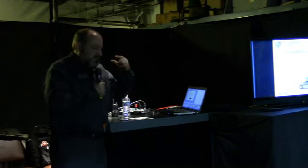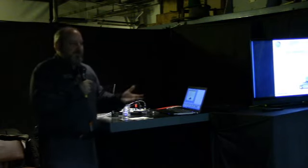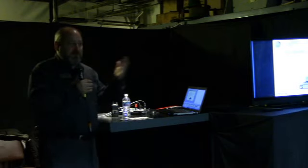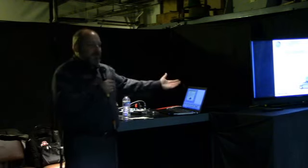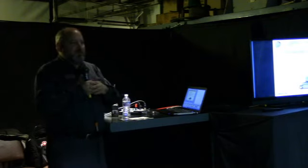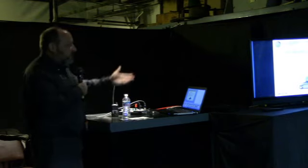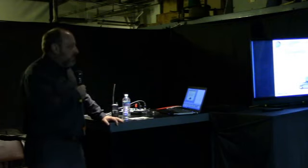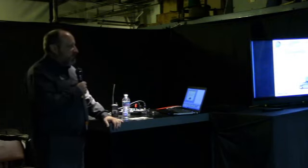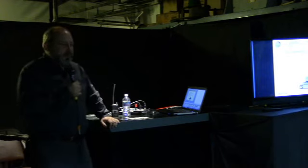And for some reason, hams, although we always complain about the lack of availability of 2-meter pairs, there are solutions available like going narrowband to narrowband modes, which can be analog, narrowband FM. Nobody's actually interested in doing that. It's far more fun to complain about not having 2-meter pairs or something. I'm not sure why that is, but anyway, you do get significant spectral efficiency. You can pack 3 of these channels easily with guard bands inside a standard 25 kHz chunk of spectrum.